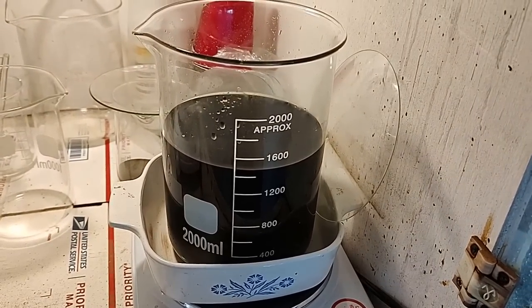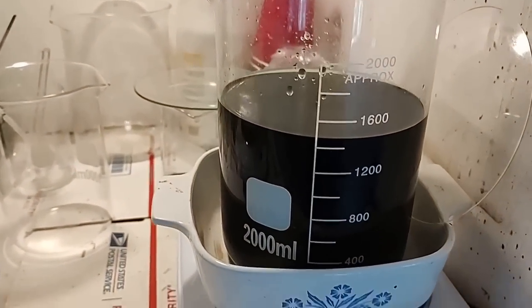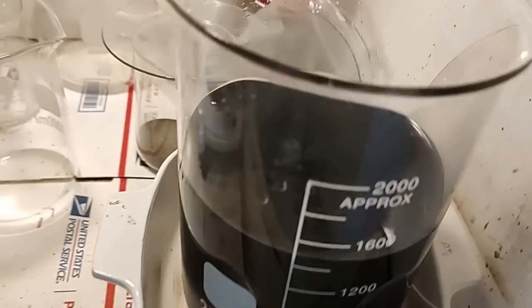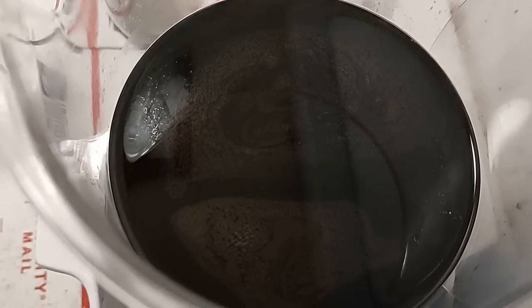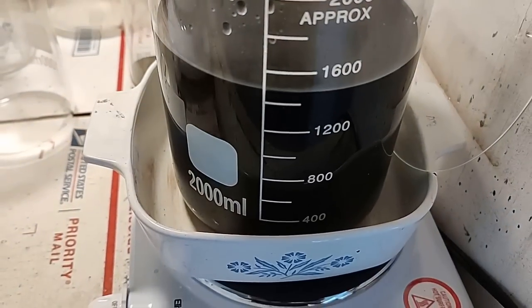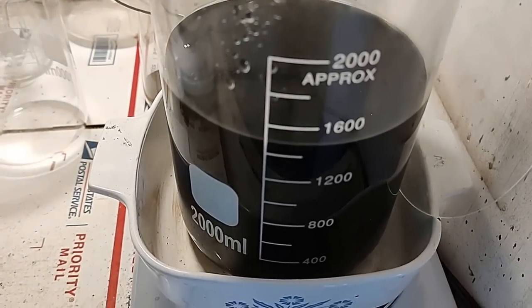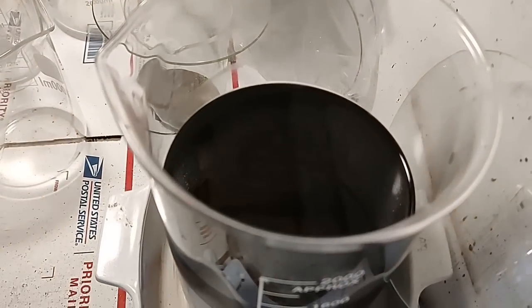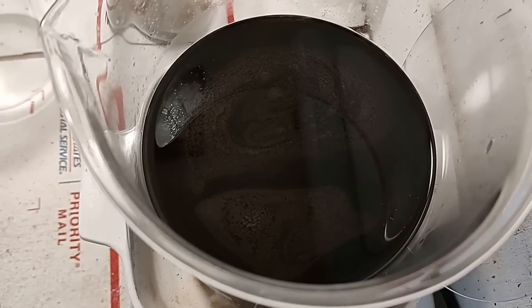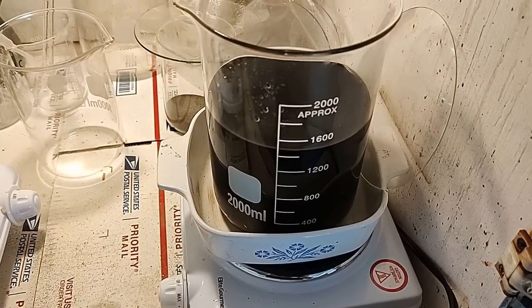It's the next morning. This has sat here and the liquid has cleared a lot. There is a film of something on the bottom which I'm assuming is gold, and there's a film of stuff floating on the surface which really looks like gold too. I'll pull it out of the fume hood for a better look — it's kind of transparent and there is a film of stuff on the bottom. I'll use my water spray bottle to knock the stuff on the surface down so it sinks to the bottom, getting all the gold in one place.